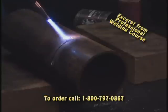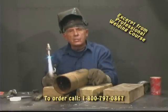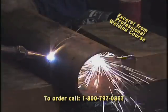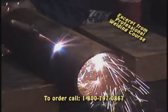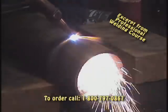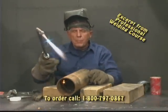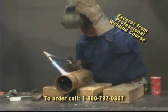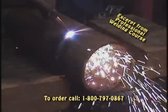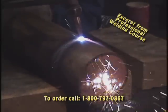You notice that little circle that I made right there? That's so I know that I can come back in and start. Now I just rotate my pipe over, come back in, start it on the outside edge again, come up, keep my direction the same. Try and stay 90 degrees. Make a little burn out, roll my pipe. Stay 90 degrees as much as I can — that's going to keep my cut even, keep my heat even. Go as far as it's comfortable for you; sometimes you'll go over the edge.